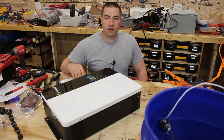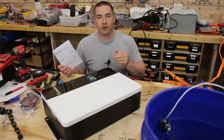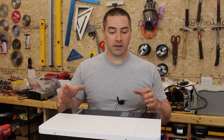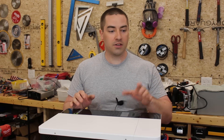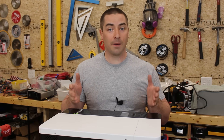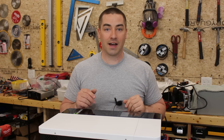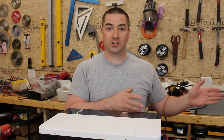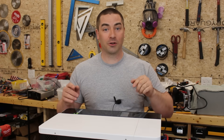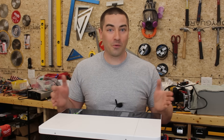The inverter worked well with the water heater — drawing about 4.1 kilowatts from a 4500 watt element. The menu has 50 different options and was easy to navigate without needing to hook up a computer. This was part one of the review where we looked inside, played with the menu, and successfully ran a 240 volt load. In upcoming videos I'll hook this up to my outdoor 5.1 kilowatt solar array to test charging performance — the inverter should handle up to 6,000 watts of solar input.